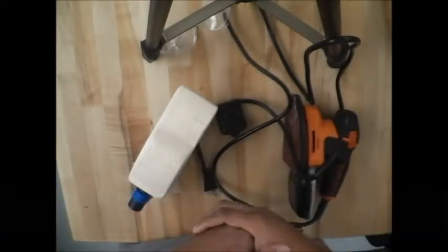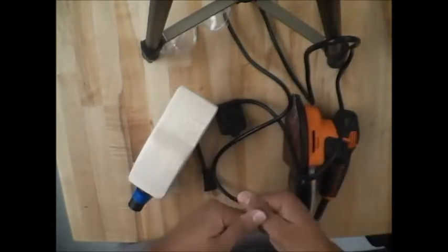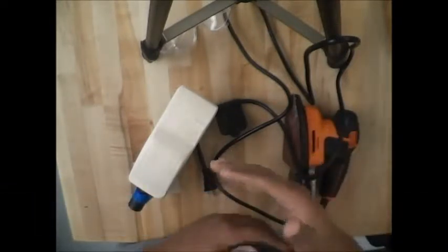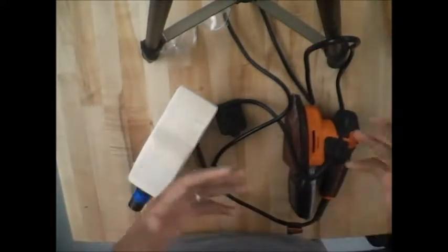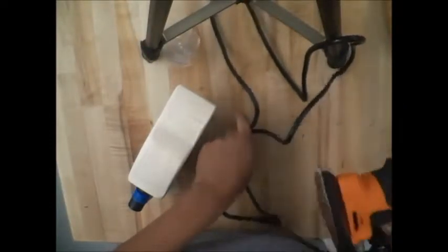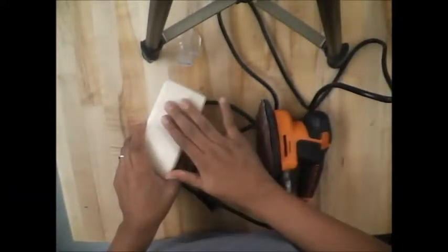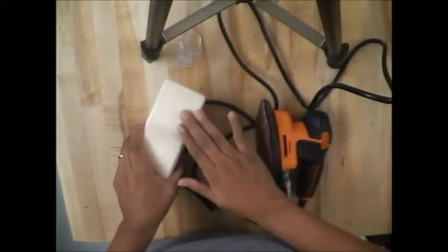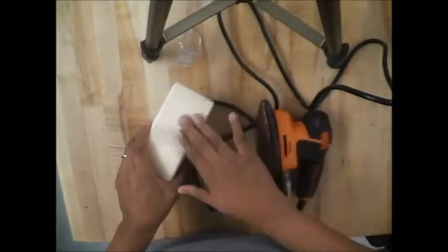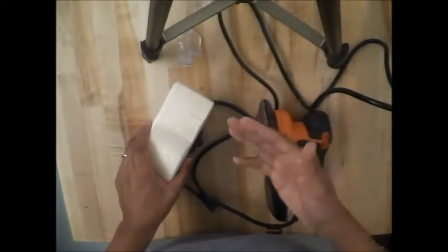The step below those are more fine-tuned but still take off a lot of material — those are handheld belt sanders. We don't necessarily use those in class, but they're the next level below the belt and disc sanders. Underneath handheld belt sanders, we have mouse sanders and orbital sanders. These are more for fine sanding — they'll smooth things out but still take off quite a bit of material. Use these once you have your shape, but want to fine-tune and smooth before moving to hand sanding.